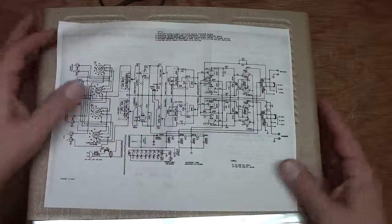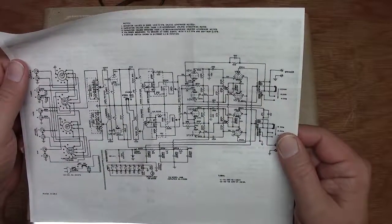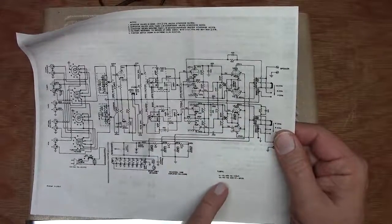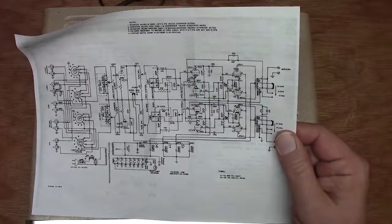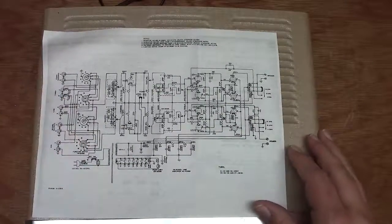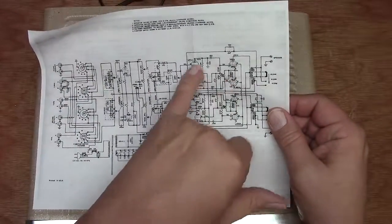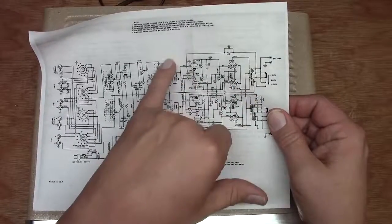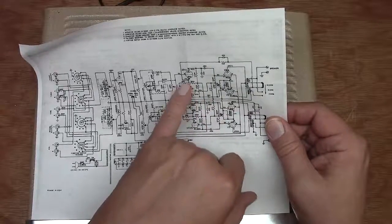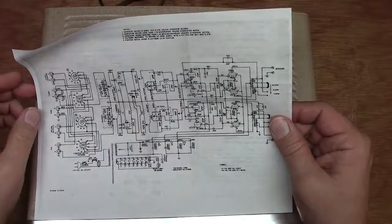And up here, the tube complement is actually using 6EU7 dual triodes. And these 4 output tubes out here, there's right and left channels. Those are 6AQ5s. And then it has the switch network over here to switch in the proper impedance for the speakers that you have. It does have feedback that comes over the top here. It's coupled into the output transformer back into, it looks like, the cathode of the driver, the phase inverter.